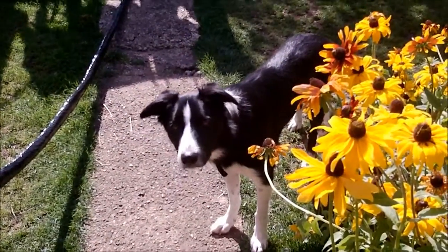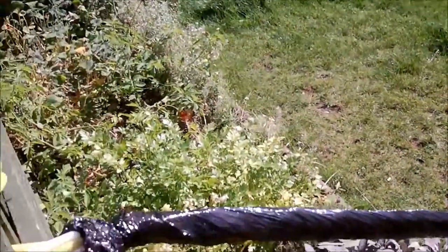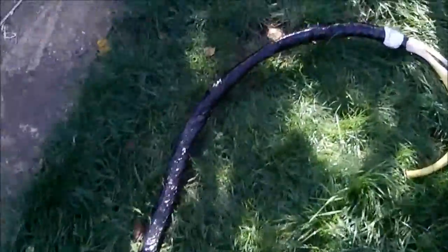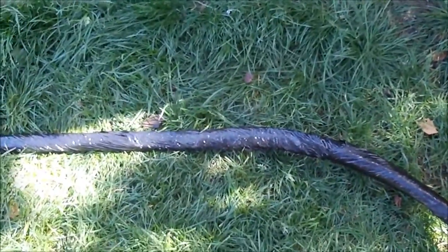So next we do another layer of shrink wrap. That's the second layer of shrink wrap on top of the foil — it's in there somewhere, you probably can't see it. So we'll run along the pipe again just to see — it's beginning to take shape. At the end there's the foil, so we've got: shrink wrap, foil, shrink wrap, then the pipes. Now I'm going to recycle my old insulation and get that on as well.